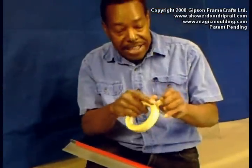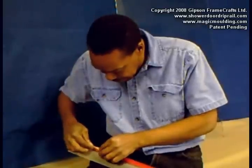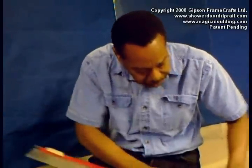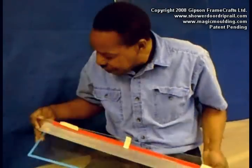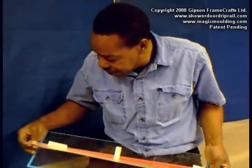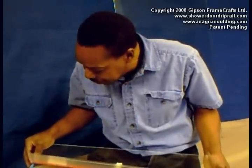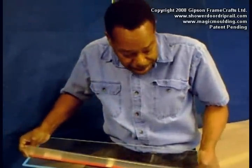Take some masking tape — you can use any kind of removable tape — and I'm going to place it in a couple of spots along the drip rail just so it'll hold it in place. It doesn't really matter how precise it is. I've got this liner already started over here on this end. We're after roughly an inch and a half, two inches up, and we'll make this even with the edge. On this end, about three quarters of an inch off the bottom.